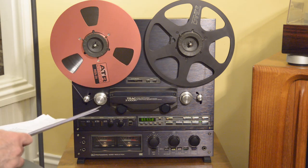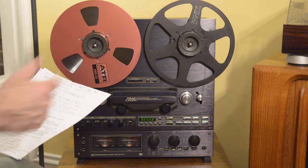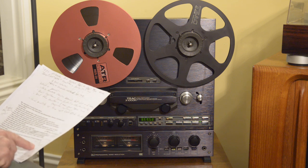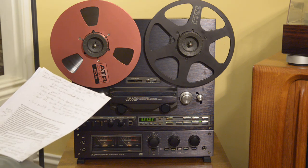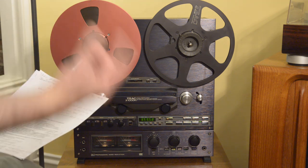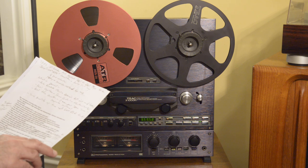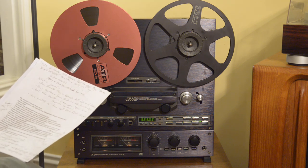After the full audio alignment, the playback frequency response — which is actually the more important one — is plus 1.9 dB, minus 1.5 dB, well within the spec of plus or minus 3 dB. The overall frequency response is actually generally a little better than that because you can compensate in your record for any deficiencies in your playback. That's why you want to make sure your playback frequency response is excellent first, before you start adjusting your record.